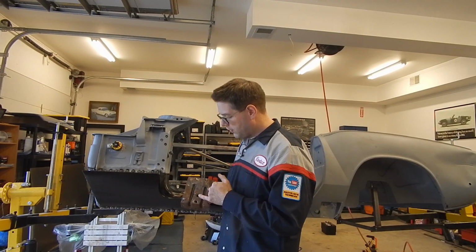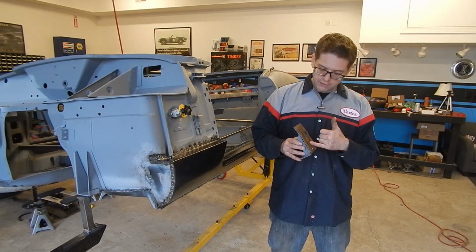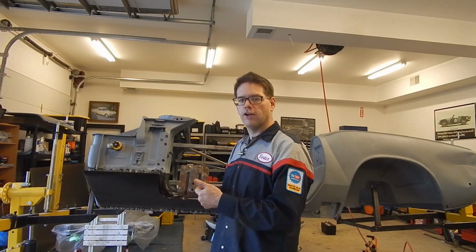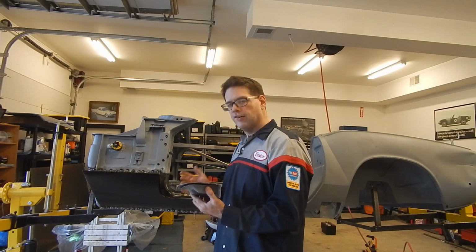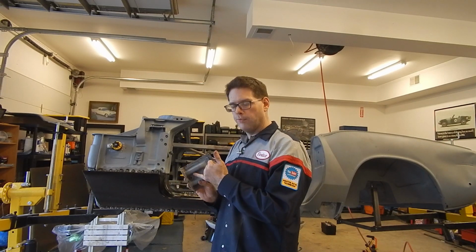Another part of the issue is that these bolt holes where the trailing arm bolts to and goes through are kind of pushed through and almost riveted, it looks like here. I know it's a little hard to see. I'll try to take some pictures and upload them in the video. So I need to figure out how these two pieces are assembled and disassemble them, and then remake this back piece and then use this bracket.